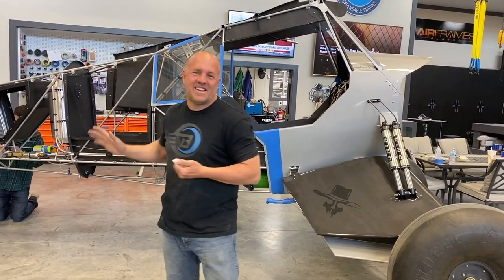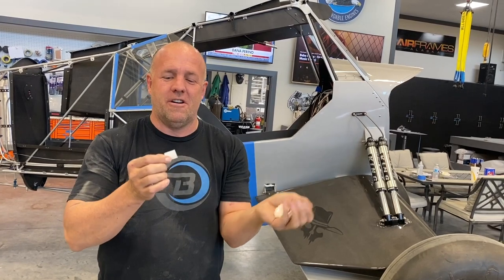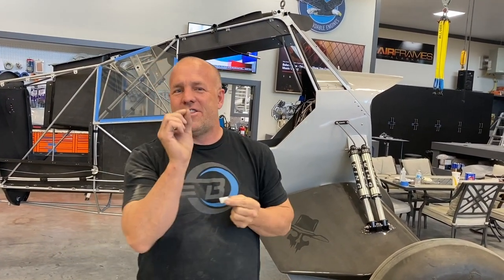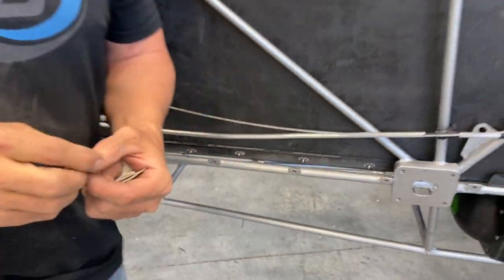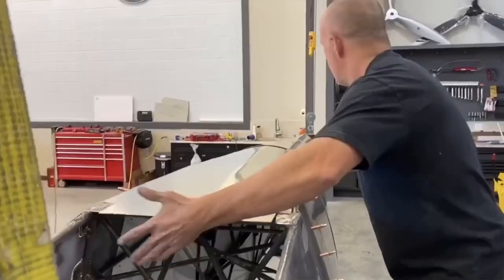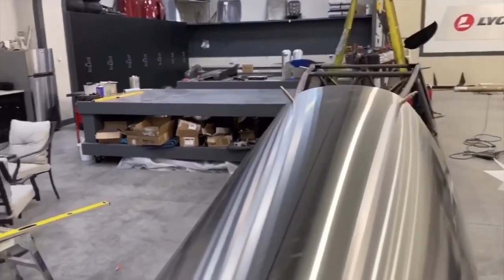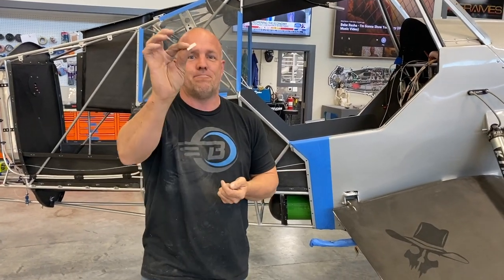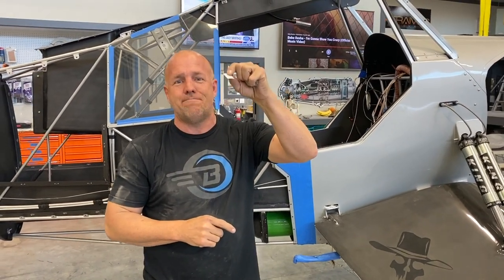I am so close — I'm getting ready to put the tail on the plane for the final time. It's final assembly. All I've had left is cutting up almost 200 of these little isolator pads. They're just a clear thin isolator that goes on each of these hundreds of bolts that bolt the carbon fiber fuselage to the frame. When I built that, I had a 0.035-inch thick aluminum skin that I wrapped the frame with — that was an intentional thickness. Then I made the carbon on that, which actually made a 0.035 gap. After the nut plate, I get the appropriate thickness offset spacer — it eliminates vibration and stops galvanic corrosion between the two. So I've got to stick all these isolator pads on. The belly's going on, and we're going to have it as done as I've ever had it.